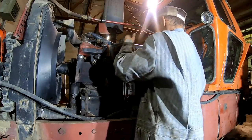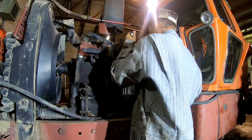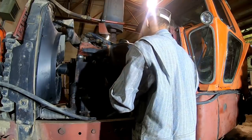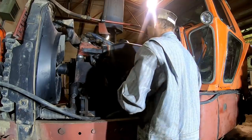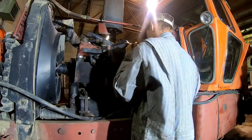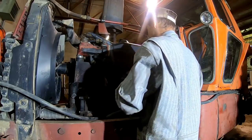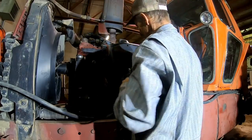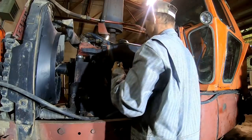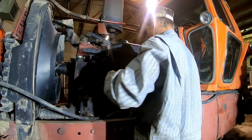It's kind of weird. Well, I went over there and I couldn't get my Texa unit to communicate with it. Anyways, got to go back over. There's something going on with the CAN bus or something, or the ECM in it. Not sure yet. I couldn't get anything to communicate with it. I've got a ProLink too, and it's an older ProLink for Detroit. I couldn't get it to do anything on it either.